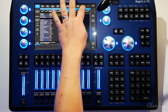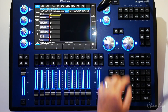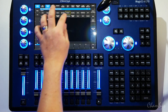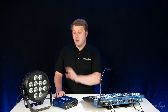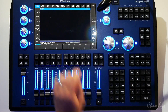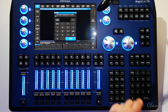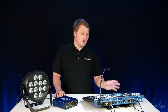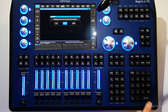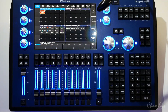I'm going to start a new show on my console, select yes and select normal live mode. I'll go to my patch window, choose head, find Chauvet, find my ColorDash PAR hex 12, and select its mode — I've already put the light in 12 channel mode. I'm going to patch it at Universe 1, one fixture starting at channel 100. That's one light at Universe 1 starting at channel 100. Press Enter and yes. The fixture is now patched — if I select the group and locate, on comes my fixture.